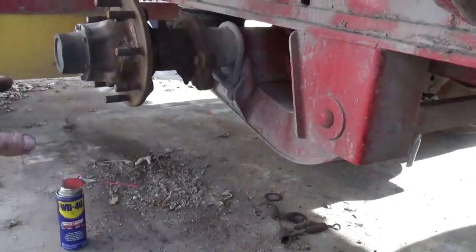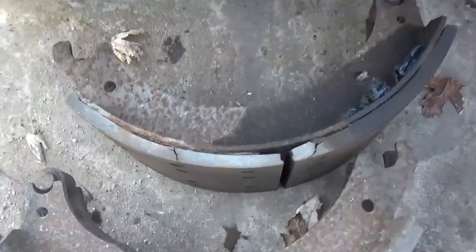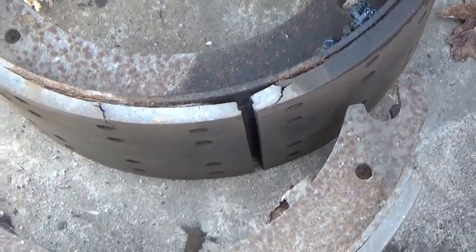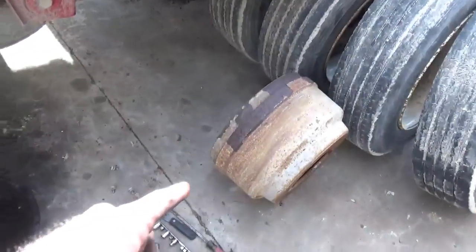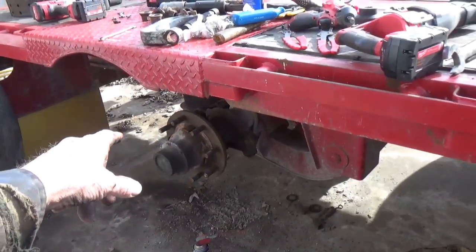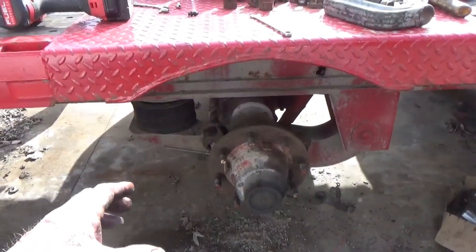Okay, the brake shoes on that one were cracked really bad. And I have to replace them. So here's the brake shoes that were on that. We're not allowed to have these cracks like that, and that was on the side where you can see them. So the shoes that were on this one here, I'm going to take those shoes and that drum and put them over here. But I've got to try to do a little bit of repair over here before I do that, because I do not have the time or the parts to redo this axle like I'm doing the other ones,